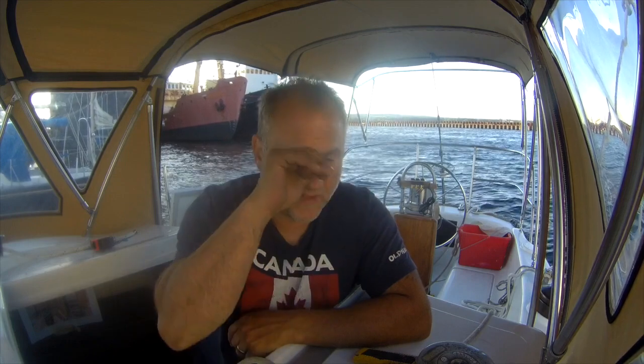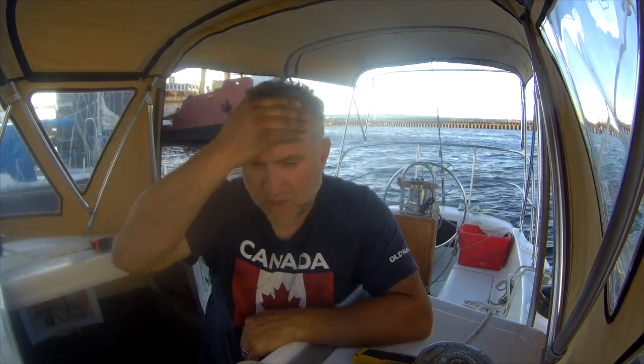Even though I didn't quite have things aligned, my neighbor Dustin here gave me a hand. I popped over and he took a look at my pulley alignment, and he showed me that because it's a 1.5-inch wide belt, if the front is a different tension than the back, then that's how you can tell which way the alignment was, and it was wearing a little bit funny. So I can see that I straightened it a lot more, but it needs a little bit more straightening.